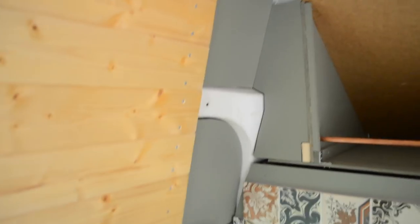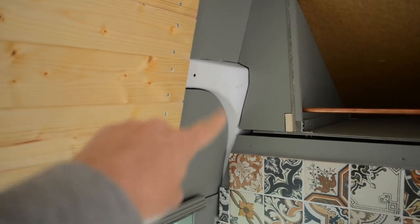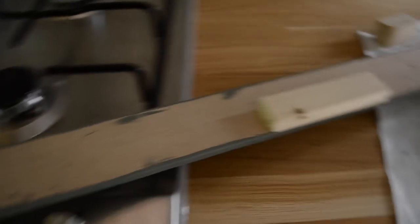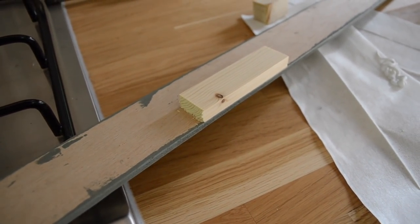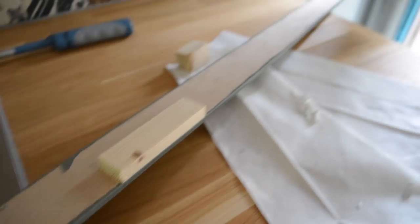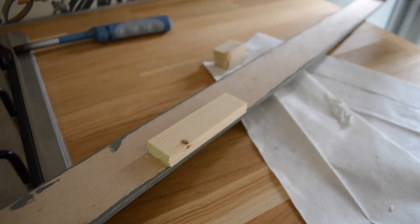It's now an hour and a half later and Jordi just installed those three pieces. It doesn't look perfectly finished but everything is kind of closed off and I like it. We added some beams — one in the middle and two at the ends — to attach one piece to the ceiling, and we'll also add some adhesive there. We just added small beams that stick to the rest of the cabinets, and we tried to finish off the edges here with corner profiles.